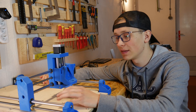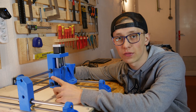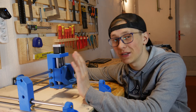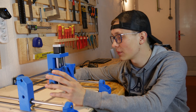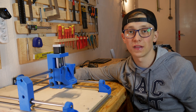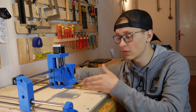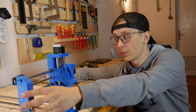The mechanical assembly of the CNC is ready. I also already faced a problem with the double nuts I wanted to add to each lead screw — unfortunately the pitch of those nuts is completely different than the pitch of the lead screw, so I can't use them. I have to order them online and I'm not sure how long shipping will take, so I'm not going to do this upgrade in this video. Right now I will put the aluminum profile in place to protect the lead screws, and then assemble the electronics and take pictures.